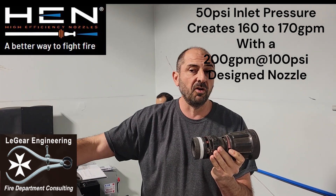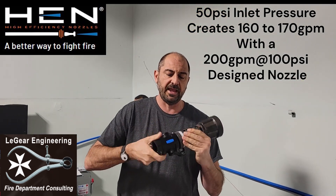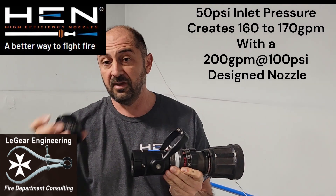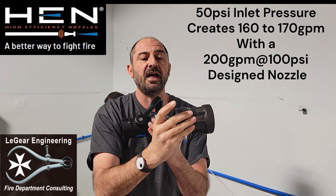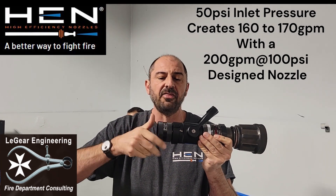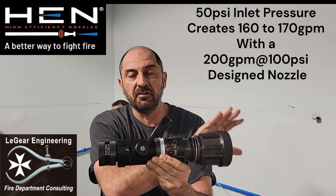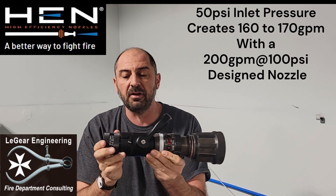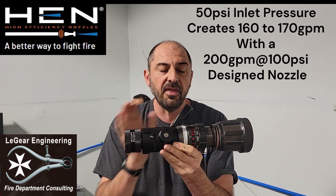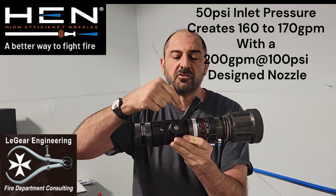Now, you're obviously going to have a problem with your hose like this because you don't have good low pressure hose. So the way we're going to fix that is here's your existing nozzle setup — you have a shutoff and this type of nozzle. It's set again at 200 to 100. I'm going to put this in the back of it. It's the turbo back pressure device, designed to allow 160 gallons a minute through it with 25 pounds of friction loss. So now when I screw this together, what we see is a package. When this is set at 200 to 100, we're going to shoot for 150 to 160 gallons a minute with only 60 pounds nozzle reaction, but we're going to have 75 pounds of input pressure — 25 here and 50 psi here. I've done this many times before for agencies with this type of nozzle where we've switched to the 200 at 100 setting, but we treat it like a 50 psi nozzle.